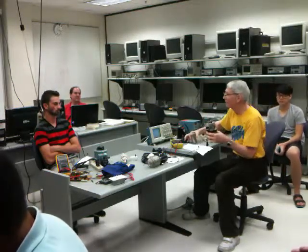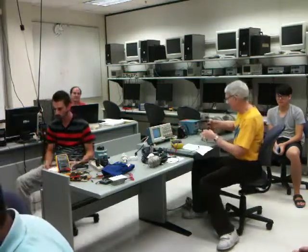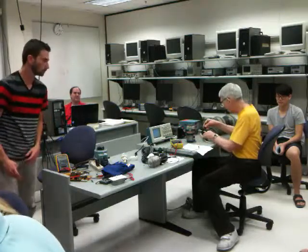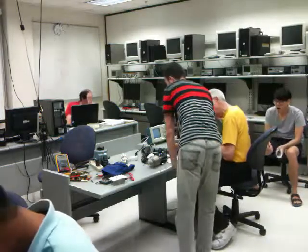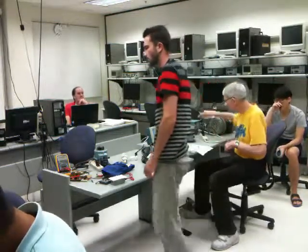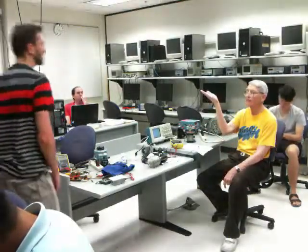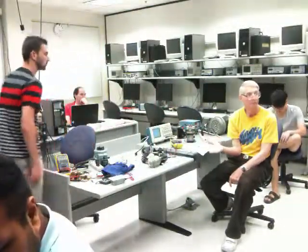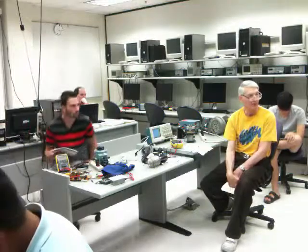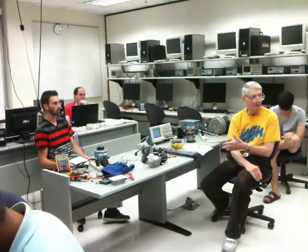It might get it right. Please go back and look and see if it's a little better. So the IRMS was higher, 1.8, and when we connect the right-sized capacitor, it went down. Would it go down to 0 if we do this power factor correction? We can correct the imaginary component of it. But there's still a resistive component to it.